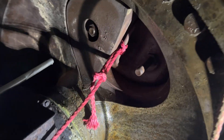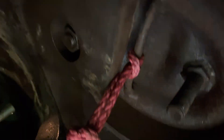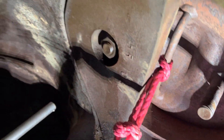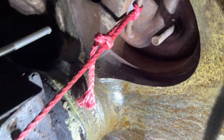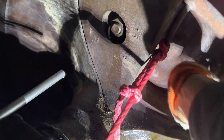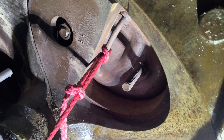You can see right here we got one side off. This is just a capture plate — that's why we have that in. We have it wrapped around the handrail to keep tension on it. Then we've got to push this in, drop it, spin it out, and replace the gasket. One important thing: you have to have the steam locked out for this, because there's steam going in here. When you take this off, be mindful — this isn't just locking the line shaft out, it's locking the steam out.